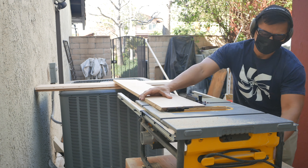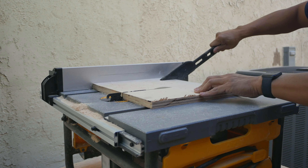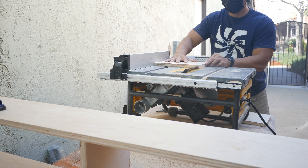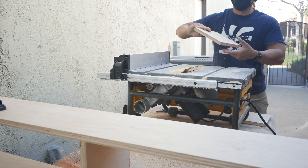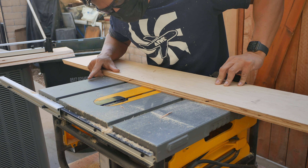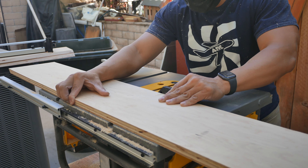With the 45-degree angle there's no way for me to make it perfectly without eyeballing. This cut here is for the middle section of the bookshelf and the outside. Here's the 45-degree angle cut on the outside — I had to eyeball it first and then make the cut. To give the center some support I decided to make a dado cut for extra strength.